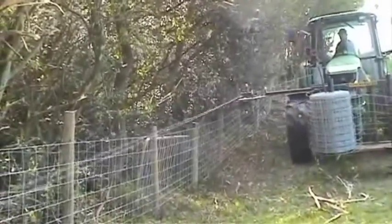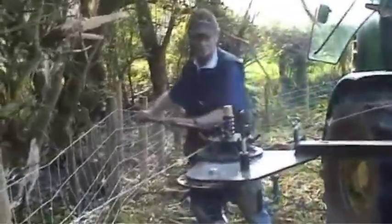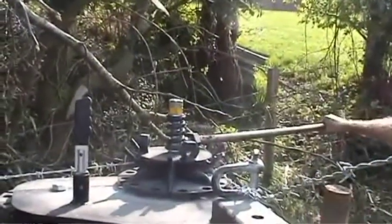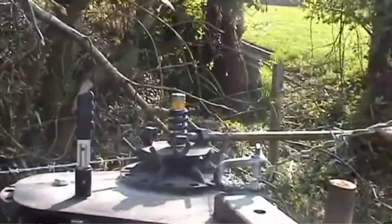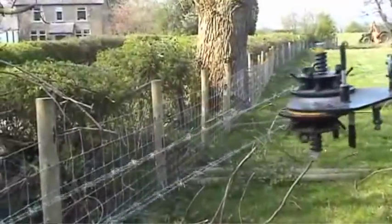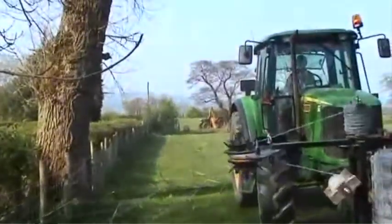This, you don't need to be in a straight line or anywhere near your fence. Go around a strainer if you pull up at 45 degrees. Here we are, putting tension on. It's a lot safer than any other method. You can feel it, you can stretch your wire, and then give it a bit more. Here we are unrolling two at once. You don't need to be near the fence, you can go around obstructions and then back in again.